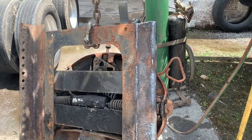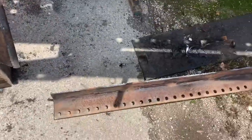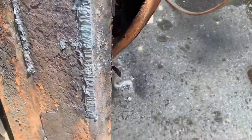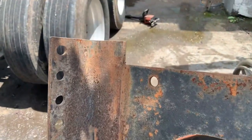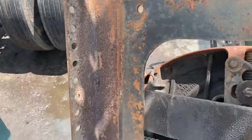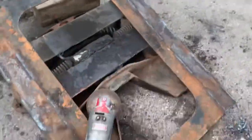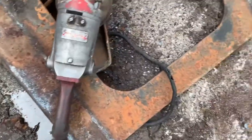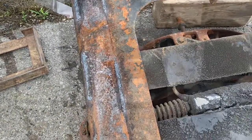Five minutes later — all right guys, I got one flange off, laying on the ground. Just used the cutting torch to blast right through those welds. It was actually a lot easier than I thought it might be. One down, one to go. We got both the rails off, they're laying over there. I'm about to take Big Bertha here and clean up these old weld marks, get all the rust off the bottom of that thing, and get ready to weld back on.